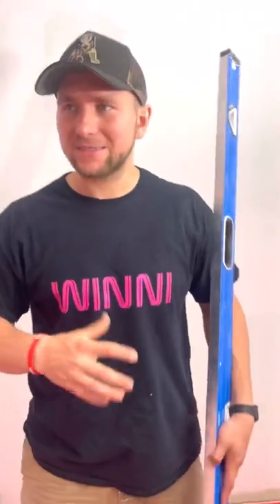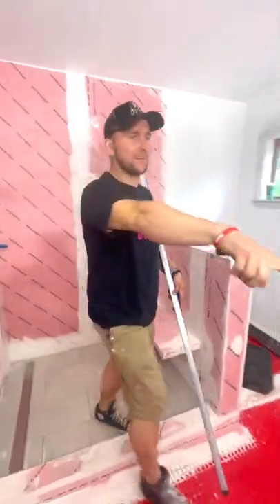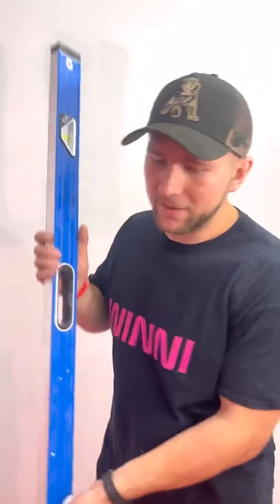The first thing you have to figure out is where do you start tiling? Our main feature of this entire project is this beautiful bathroom, so I'm going to focus right here. On this side we're going to have a massive wall-to-wall vanity, so anything that happens under it I don't care about. In this corner we're going to have our toilet, so anything behind it we don't care about. My tile pattern is going to start here to make this look the best.